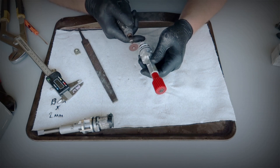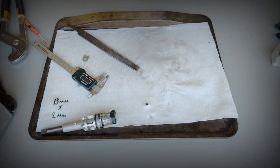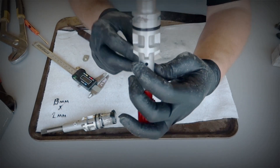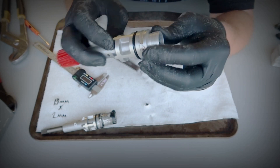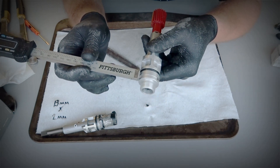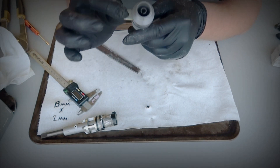We're finishing up with the grinder here. We're going to take the hand file and finish it up so we have a true nice surface. Also getting rid of all the burrs around the edge — it's quite a nice fitting part, so you don't want any burrs left behind. This is what we've ended up with — turned out pretty nice. It doesn't have to be perfect, but you do want it to be at the same depth. Your little keyway is going to sit in there, so just verify the height is the same from left to right. In this case it is perfect. There's the little keyway — just make sure it fits in there, and it does. You're set.